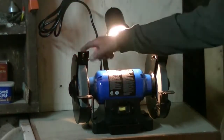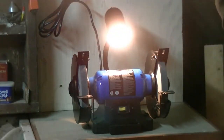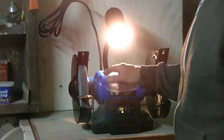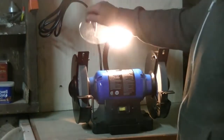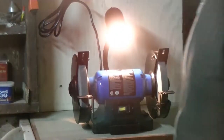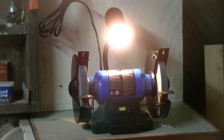The deflectors here, spark arresters, whatever they want to call them, I'm leaving them on. But because the wheels are slightly out of true, okay, they have a little bit of side movement, these things just vibrate like a Mad Hatter. And it's very annoying. So, I think the out of trueness could just be the stones. Anything's possible. It could be the way they were mounted. I just have to get motivated to take the side covers off, pull the stones, reset them, and if that fixes the problem and I can use those things, fine, but otherwise they're staying off.